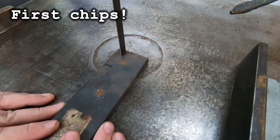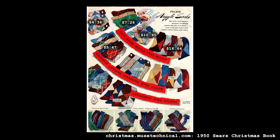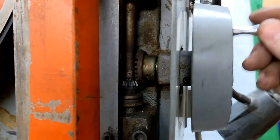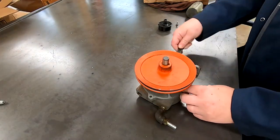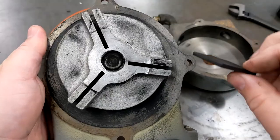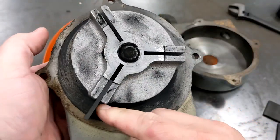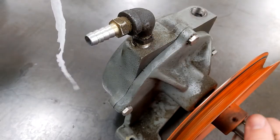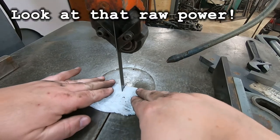At long last, I could learn all its subsystems. It's a beautiful old thing, built in a way few things are today — which is mostly a good thing, as things used to be much more expensive. Look at this mechanism for raising and lowering the blade guard — it must weigh 10 kilos by itself. It came with a blower to clear chips, but I could barely feel any air coming out. The hoses were clear, so I pulled the compressor itself. This runs off the main motor via belt drive. It has these sliding vanes on the inside, made of some light plastic or maybe graphite. They slide because the hub is mounted eccentrically to the chamber, creating the compression effect, and this way they naturally wear down to a tight fit without needing to be super precisely machined. Cleaned up and mounted back together, the airflow was a lot better — still not great though. If I end up wanting more, I might just plumb it into the shop air system, but it would be a shame not to make use of such a neat little mechanism.